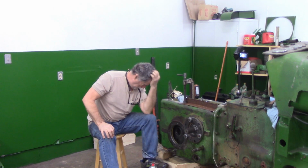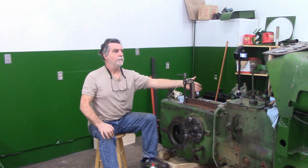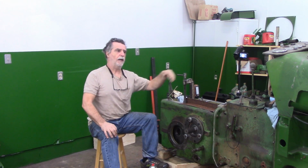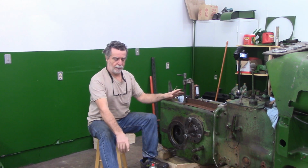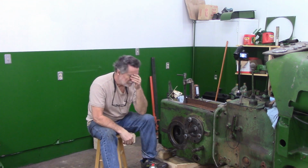I think instead of taking 40 thou from this side to that, it would be nice to try 20 over there and leave 20 here, so I still have my total. What I have at the moment, 3 times 40 is what, 120? I think I need to maintain that number to maintain the bearing preload. I don't want to be taking some of these shims and adding to this side to pull it back. I'm going to be changing bearing preloads.